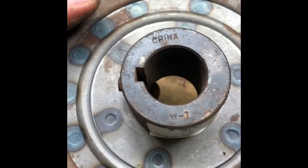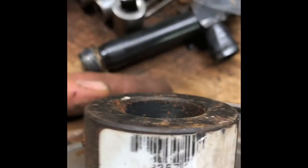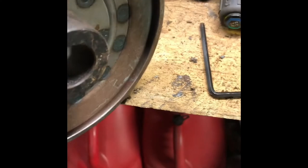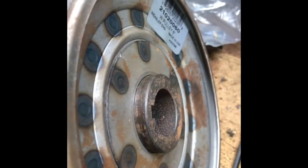So this pulley — you literally got a BV in, that's what I did. You can see it's W1, and you just get a Weasler 1-inch hub, and then you're good. You beat the thing in. Now what I'm going to end up doing with this — as you should — you should put a tack weld around it, so I'm going to go ahead and just put a couple spots on it.